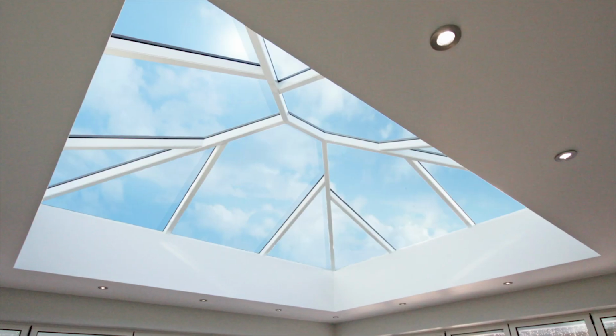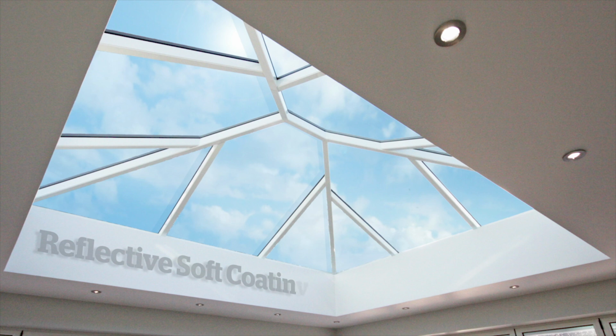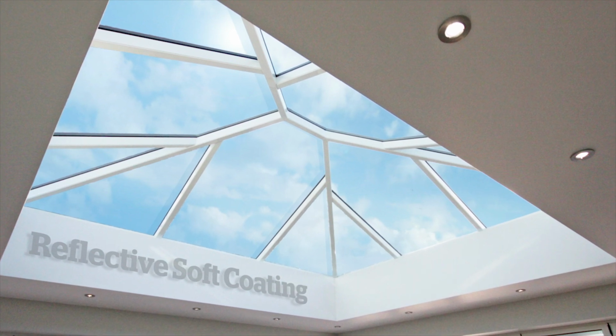On top of that, you've got a thermal spacer. The traditional method would have been an aluminium spacer, which is the part that separates the glass. What we use now is more of a composite, a plastic spacer bar. So again, with it being plastic, it doesn't let the heat transfer. You've got a soft coat on the inside, so that will act to reflect any heat in your room back in, so you're not losing it the other way.